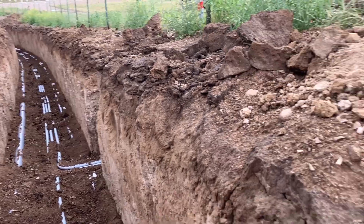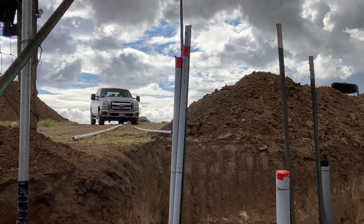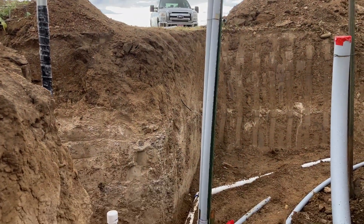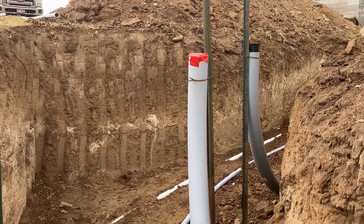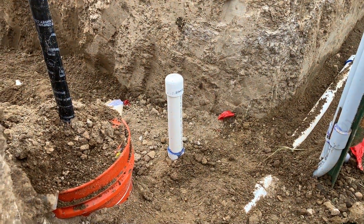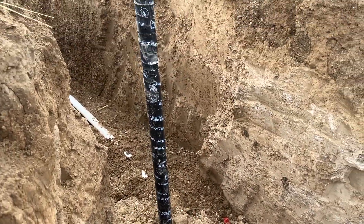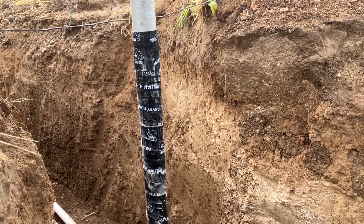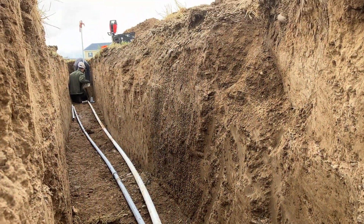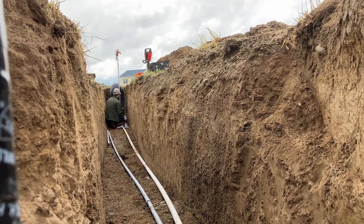Looking back this way, you can see high voltage sweeping up here — this is going to be for some heaters for the horse troughs, plus allowing us to get down to a junction box and the gate operator. You can see the three-inch sweeps coming up for the service, and then the water line comes over here and tees. This riser is for a future irrigation tie-in. Here's the frost-free hydrant with pea gravel, and we wrapped this galvanized pipe with 20-mil pipe wrap so you don't get rusting below grade on these frost-free hydrants.